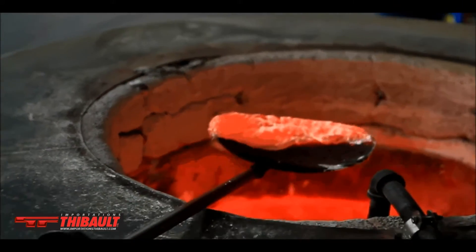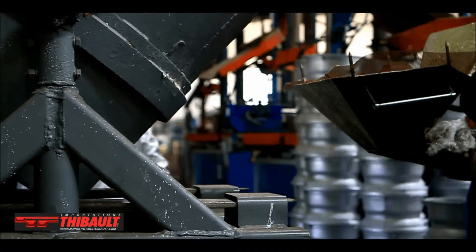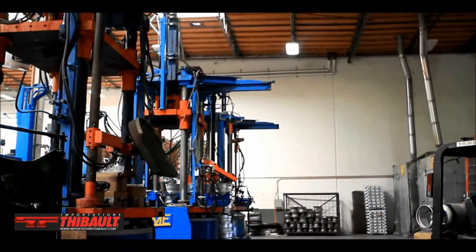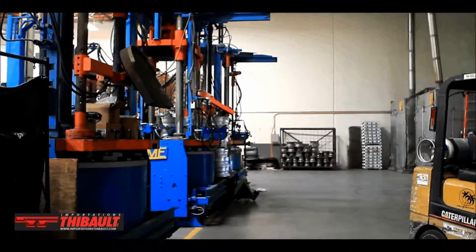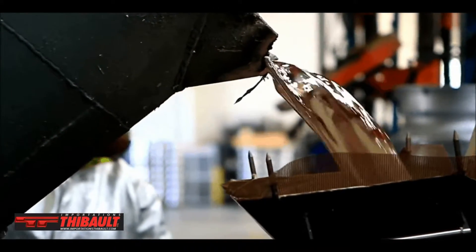The cast wheel comes from A356 aluminum. It's just raw ingots that we get and it looks like big bricks. We take those and melt them down in the furnace and we end up with a big pot or a crucible full of molten aluminum that's at 1400 degrees — a melted pot of aluminum that we take a crucible and pour into the casting machine.